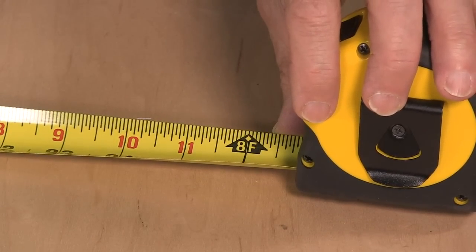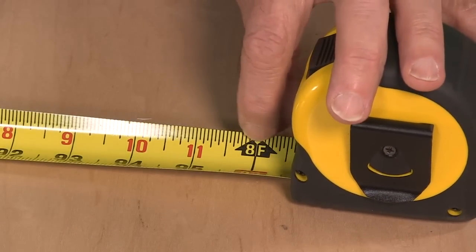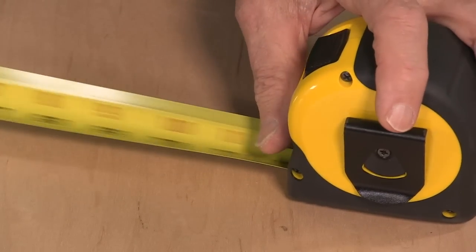So what is it all about? Well, when you're using four-foot wide panels — like putting drywall on the wall — and we want 16-inch centers, that gives us three spaces or two studs in the middle that just fit perfectly center to center, so we can keep putting four-foot panels on. That works for all things that are laid out by the width of the four-foot panel.